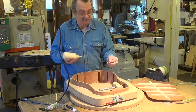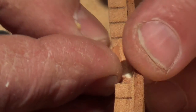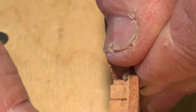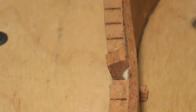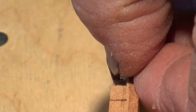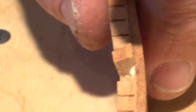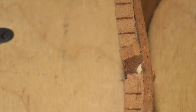I'll be able to fix this in about 15 minutes. So I'm going to put a little dab of glue. Now I can push this in here and I'm gluing to the side and I'm gluing to the kerf. Now while that glue is setting, I can take my sanding block and I'm clamping this in with my finger. And will you see it? Sure you will because you know you put it in there. The average guy won't even notice it. So now all I'm going to do is put a spring clamp on there. Give it 10 minutes and we'll be done.